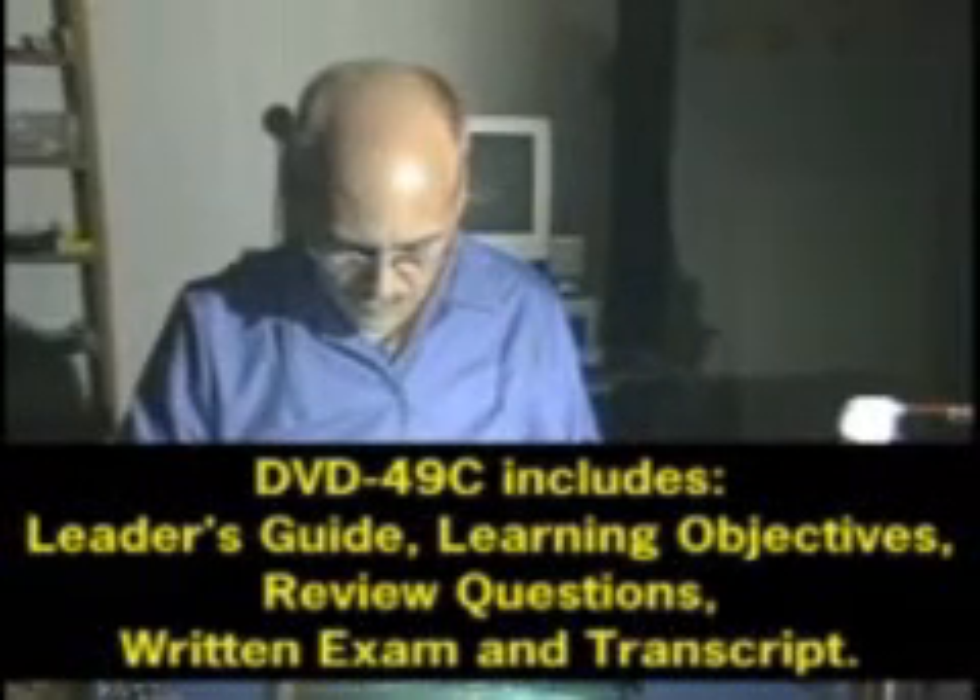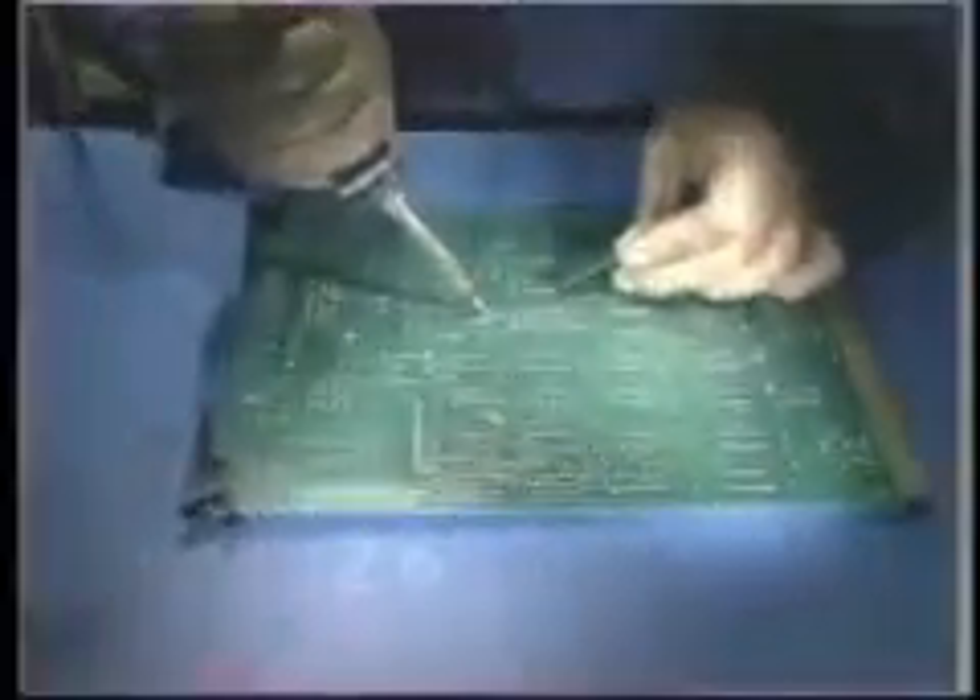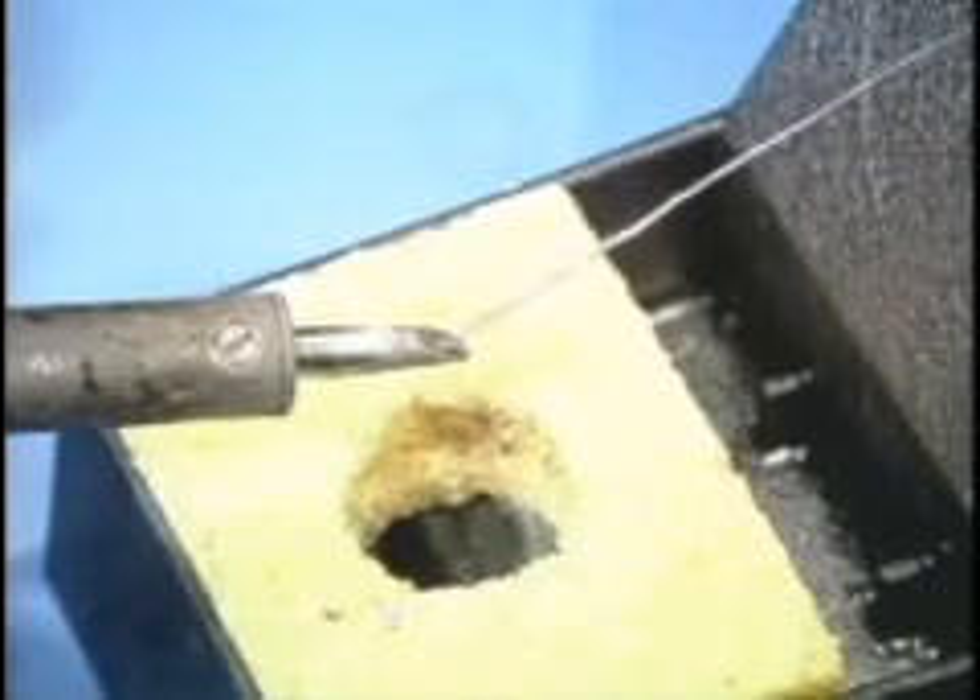Let's take a look at the list. There's excessive pressure, improper solder heat bridge, wrong tip size, excessive temperature, improper use of flux, transfer soldering, and unnecessary touch-up or rework.